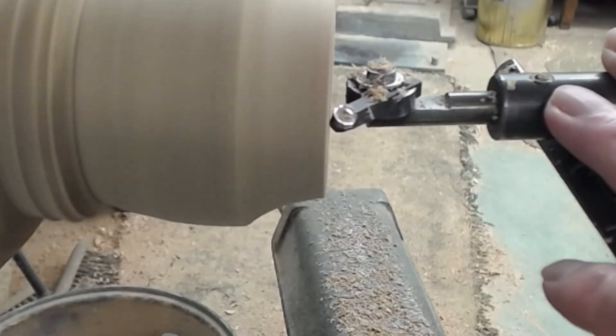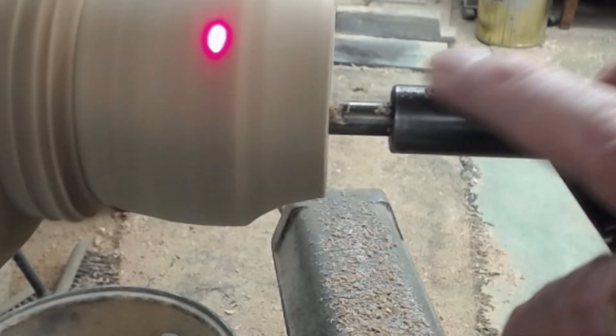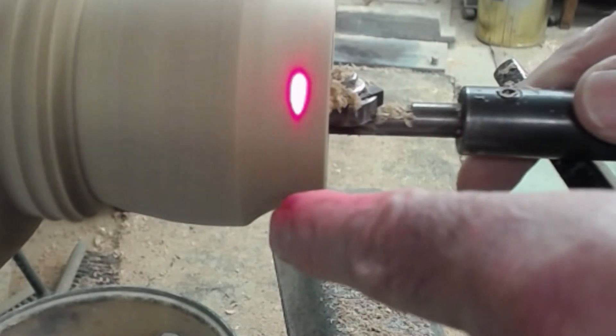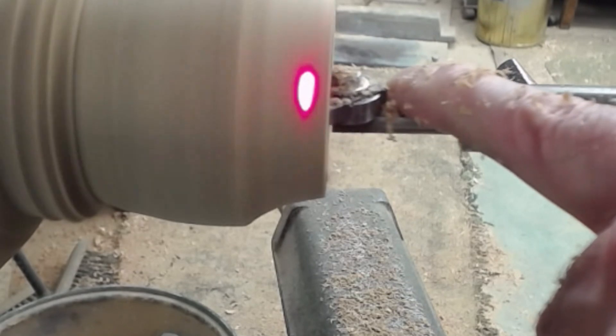So now we go inside there. We're no longer blind — we can see where we're at in there, we can see the depth, and we can see the shape of the cut happening in there. The laser gives us an early warning. When it gets elongated like that, it says slow down, I'm getting close. When the laser disappears, I stop.